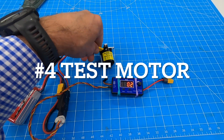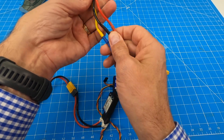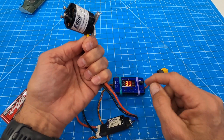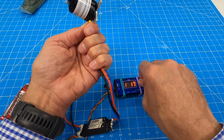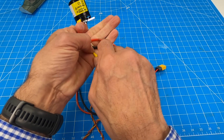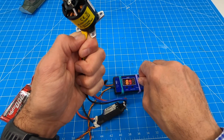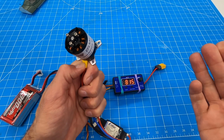Number four: test the direction of the motor. Are these set up properly? Before I put it into my plane with everything plugged up and deep into the bowels of the cowling — is the motor spinning the right way? By attaching it to my servo tester with the speed controller I plan on using, I can go through that process and rotate it. And then I can tell, uh-oh, that's going the wrong way. Flip two of these wires, run it through — now it's going the right way. Easy way to test motor direction.